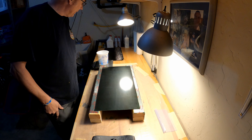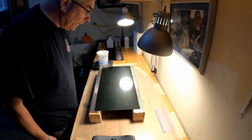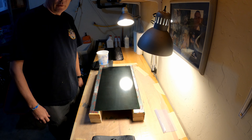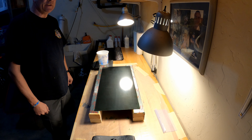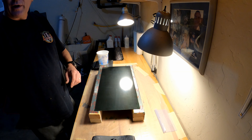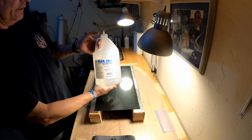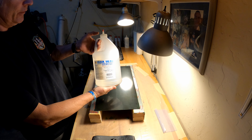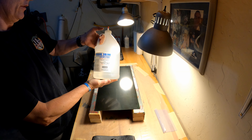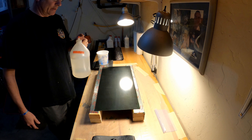Today is the big day. We have everything set up — the plate has been treated with release agent and we have as smooth a surface as we can. The heater has been going for about an hour. It is currently 16 degrees outside, so this is important. The plate is about 90 degrees, which is about where you want it. I prefer MAX 1618 out of Polymer Composites in Ontario, California — they do really good stuff. Now it is time to mix some resin.